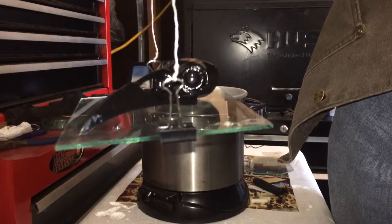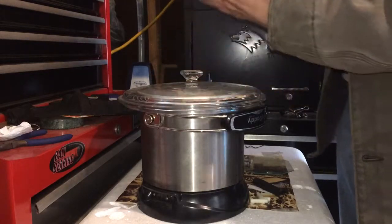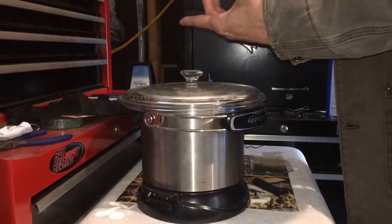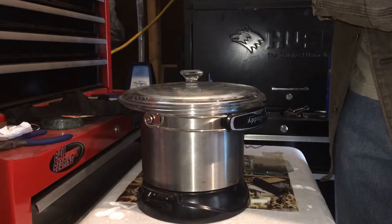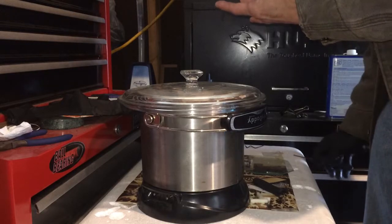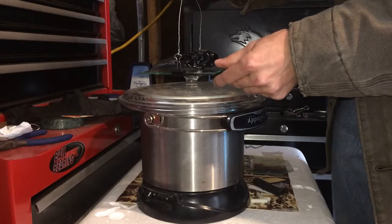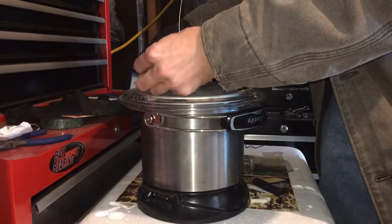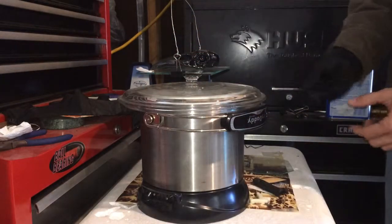You can see how the tip of the nose is kind of melted to the glass. I'm going to very carefully just lift this tip up — just a little bit — but I don't want to lift it too much because I'll rock it back and bottom out the back of the skull. So I need to pry it up carefully to get it off the glass. It came off very nicely, a lot easier than I thought. Since it's still wet, I'm going to do that one more time but this time put a small piece of paper towel underneath to suck up the acetone under the beak and stop it from melting anymore.